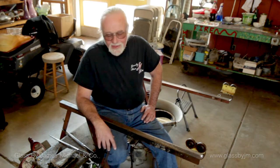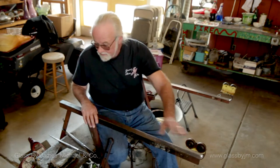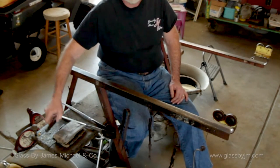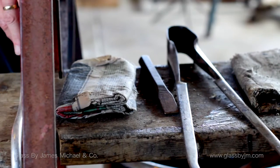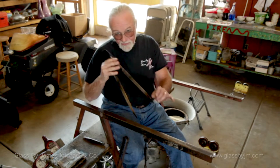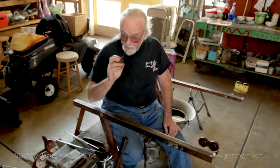So let's talk about some of the tools we're going to use. We've talked about the bench configuration with the curl and the rollers, and the seat area over here where we can put our tools. Normally when I start out, I've got exactly the setup you see here: a cold chisel, which we use to knock the piece off the pontil; a pair of jacks — these are great all-purpose jacks; and a pick or awl that we use to do bubbles, which comes in real handy.